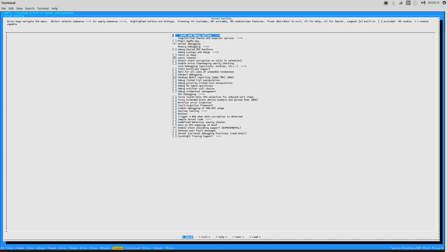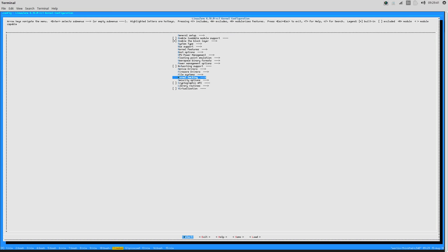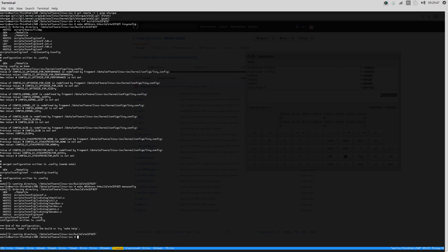Let's see what we get if we just go ahead and build the kernel. Let's do low-level debugging - the thing is that doesn't actually work because it doesn't have an option yet to output low-level messages from the STM32 UART. So that's unusable right now. That's pretty much it - not so much more to it. What I'm going to do now is just build this kernel.